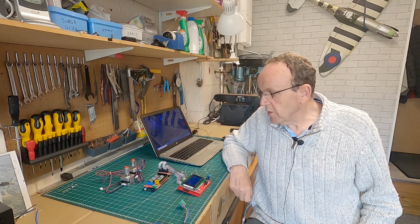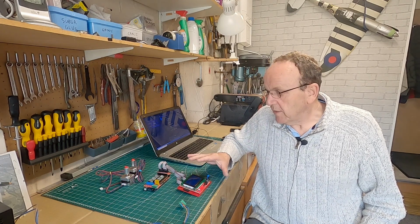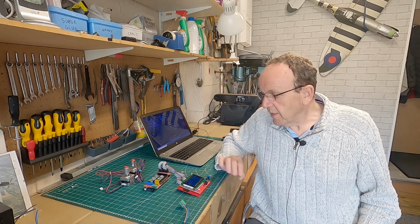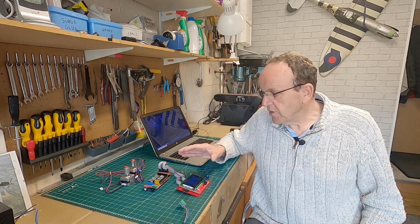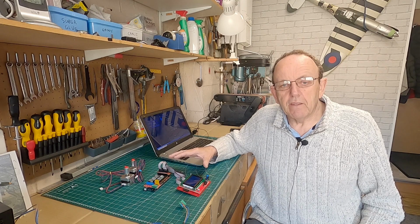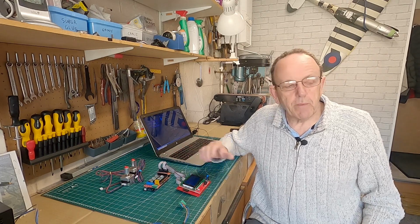Right, so what we're going to do now, we've installed the firmware, is a quick bench test and make sure it's working as we expect. Now, if you're going to build a foam cutter, I suggest you do this first before you start making the main foam cutter itself. Because if you've ordered all this stuff, put it to one side, build a foam cutter, then come back to it and find there's a problem, you might have trouble with the vendors, getting any recourse with them. So I would suggest you do this first, make sure all this is working as you expect, iron out any problems, and then go on to build the foam cutter itself. And then when you come to this section, this works. And if there's something wrong on the machine, then it can only be either wiring or some configuration problem. So that's the best way to do it.